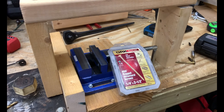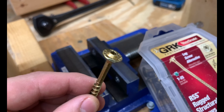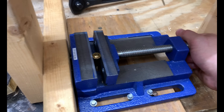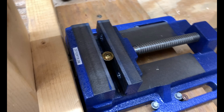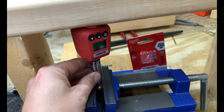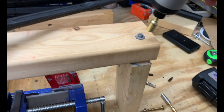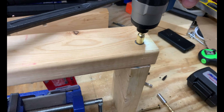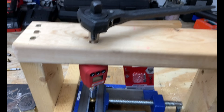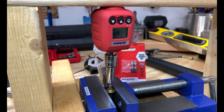In the final test, we're going to use GRK rugged structural screws. We flatten out one side of the structural screw, insert it, and tighten everything down to give a nice tight base for twisting off bits. We then select the brand of bit, place it in the fastener, insert our ratchet, and tighten things down to eliminate any extra play. Everything's lined up — let's take this to failure. We'll snap off the brand new bit first, then do the used bit, kicking things off with Milwaukee.